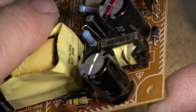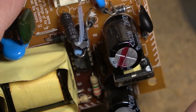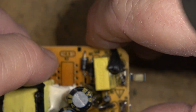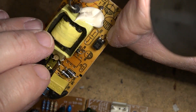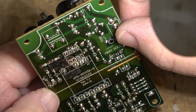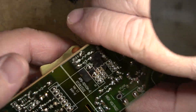What's the worst that can happen — it can go boom. The input filter cap probably should be changed on this one too — this one has a couple of them. Looking to see which pins were shorted together on the blown part: pin one was over here, so counting — pin seven and eight were connected together. And on this replacement, checking the same — yes, seven and eight are also connected together. So the chances are it's the same, or at least compatible, because it's a MOSFET and they're all going to be pretty much the same pinout.